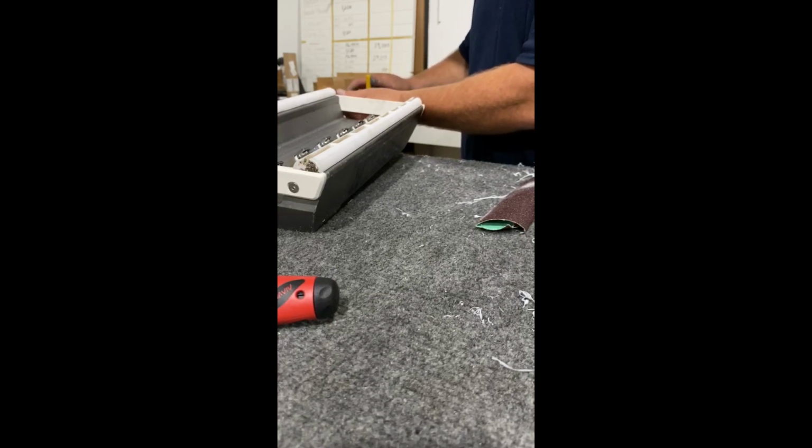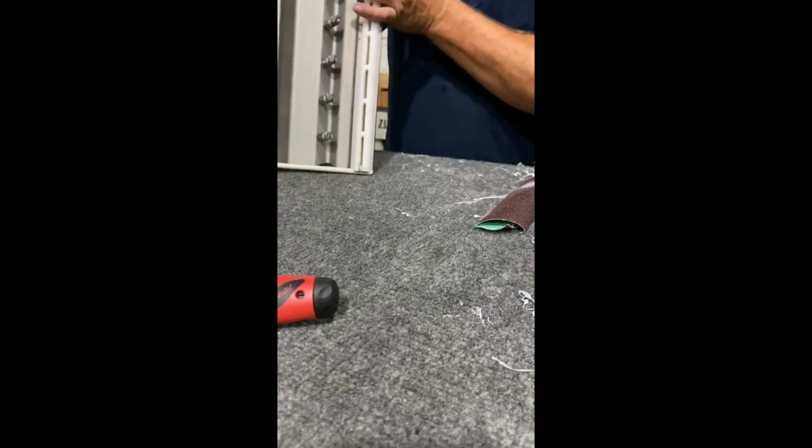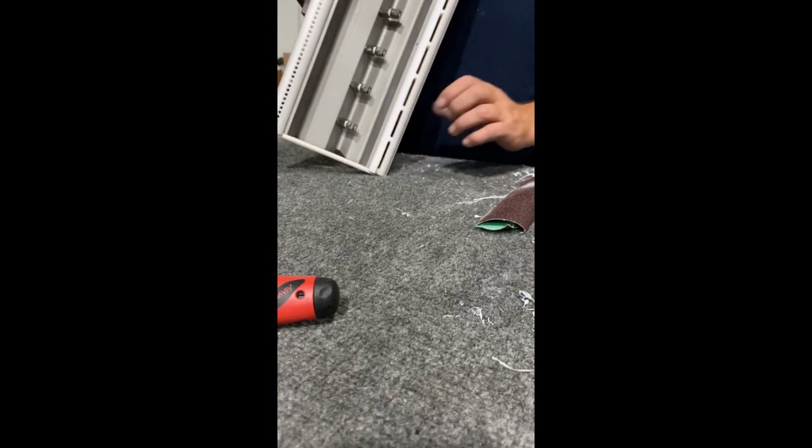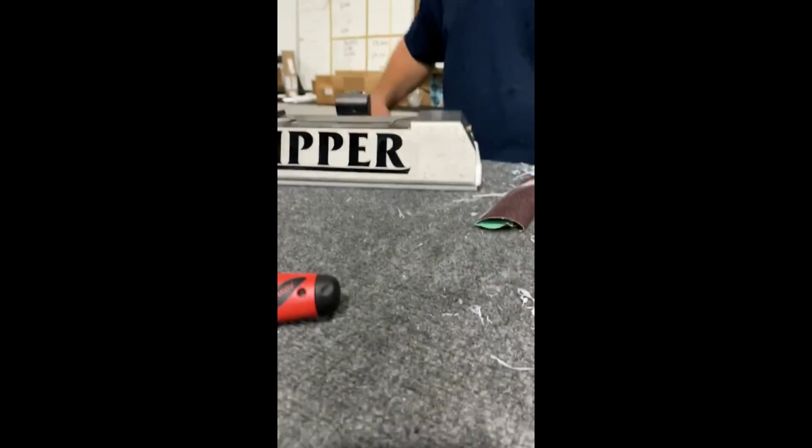Simple as that. Now, as you've seen, I showed with the wood dowel rod knocking these out. I've had guys take hammers and just beat this whole channel to death. Once they do that, the block's junk. You basically can't do anything with it, so we're on our way to a full rebuild.